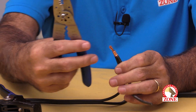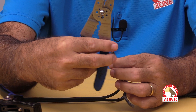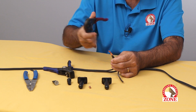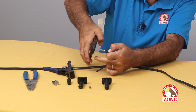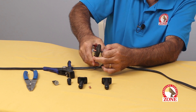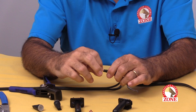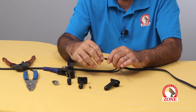You could use this part to close down the crimp, but I like to do things the best way — I use a Buchanan crimping tool. The crimp fits in there, you slide it in, line it up properly, and really crush it. Now you're crushed in on four sides and it's fully closed.